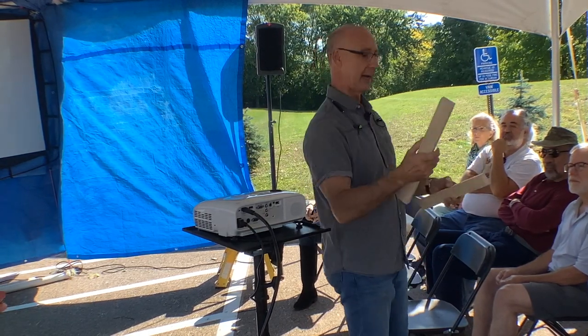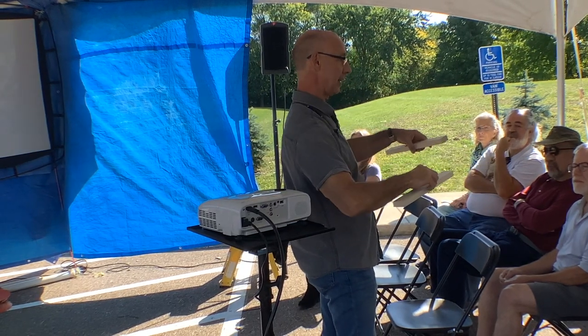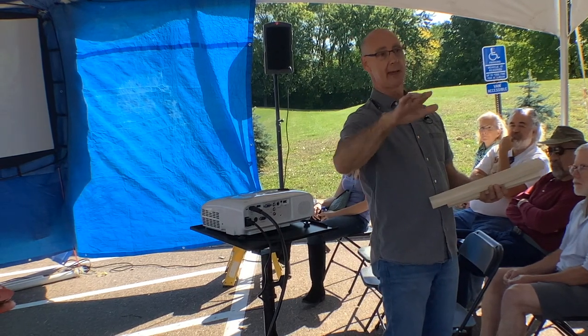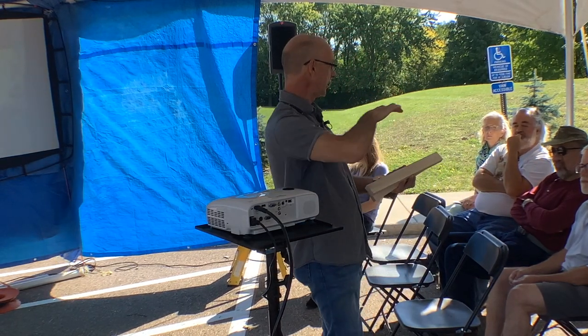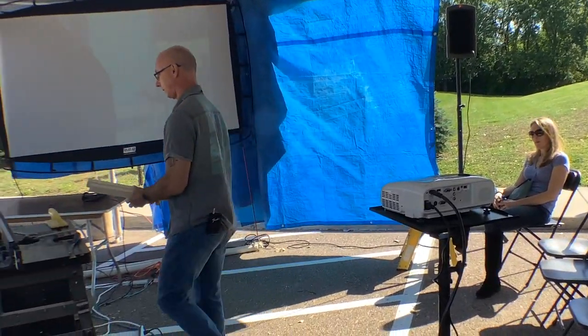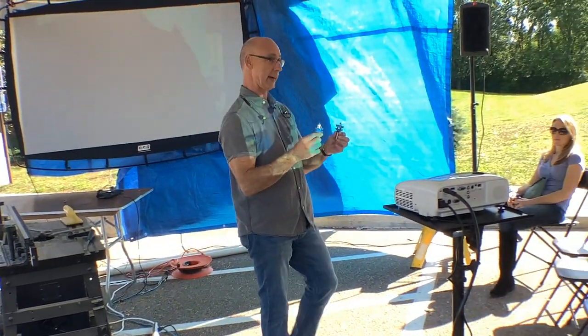With a two-piece set, good face will always be down on the table for all the cuts. And then if we go a step further, when you're raising the panel, that also gets fed good face down. So I like that we're maintaining that same reference surface for everything, and I like that then, for me, it makes door making a two-bit operation.